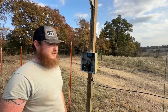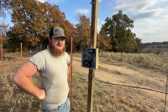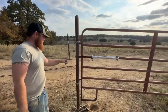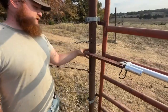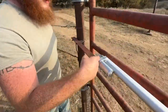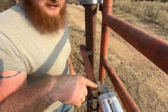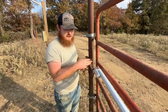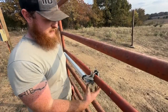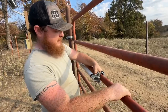You can get as expensive or inexpensive as you like. That actuator was about 50 bucks, and if it lasts a couple years, throw another 50 in. We were looking at different kits — Ghost Controls was the cheapest we found, and that's like $500 to $700 depending on what package you like. This works, and if you're looking for a cheap way to do it, the mounts we made are just angle iron. I have a pipe here and we got a pipe clamp — an exhaust clamp from O'Reilly's — drilled some holes, put some bolts through, welded the brackets that came with the arm onto there.